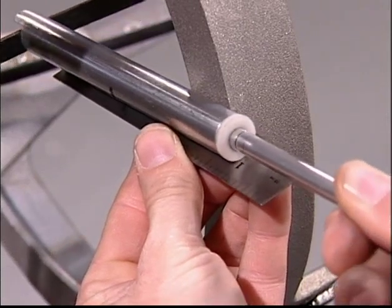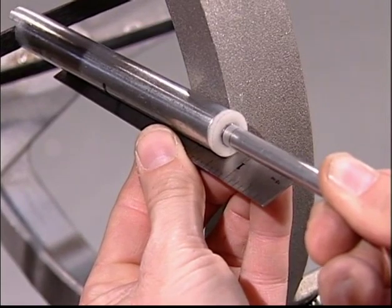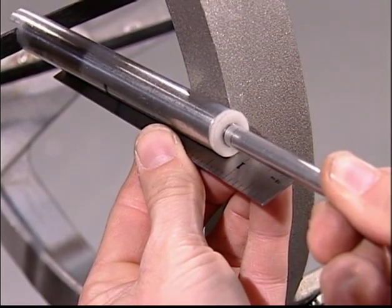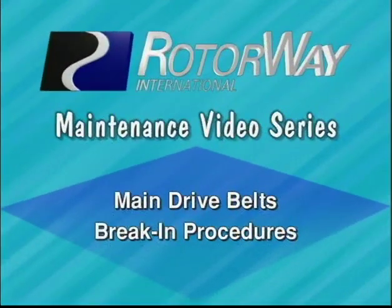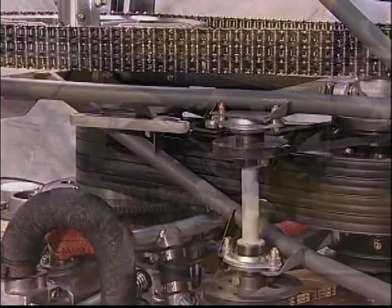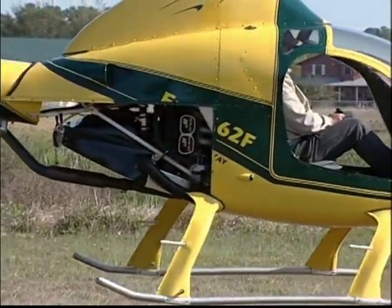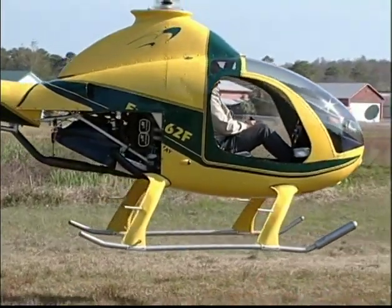Verify the belt tension at the first bulkhead. Monitor the tension on the main drive belts. New belts, depending on power demands on the engine, could require up to 7 hours to fully stretch.